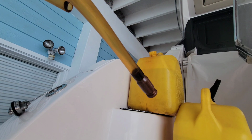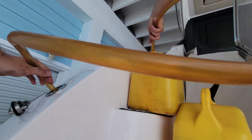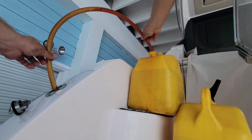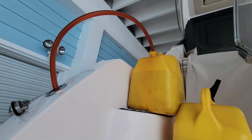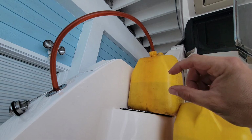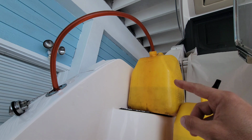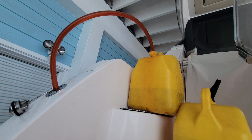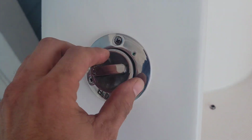Now we got our magic siphon here. Let's see if we can get it to work. It's a pretty cool little thing on the end there. It's a little brass fitting with a check ball and a little marble in it. That way you can siphon it out without having to try to suck it out with something. I definitely don't want to taste diesel fuel today. But I gotta get 3 of these in there, so let me do that. Here's our last one. Cap back on here.